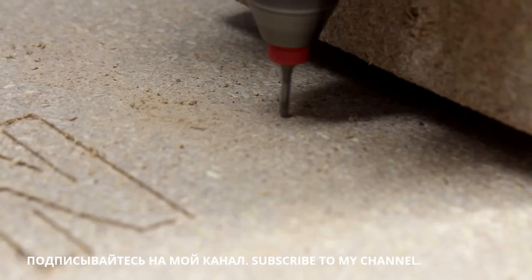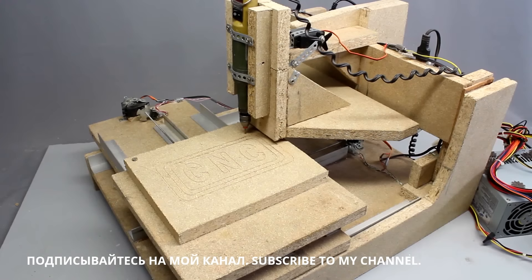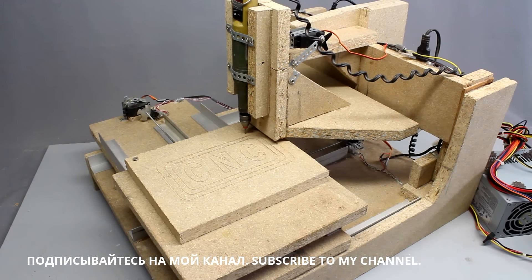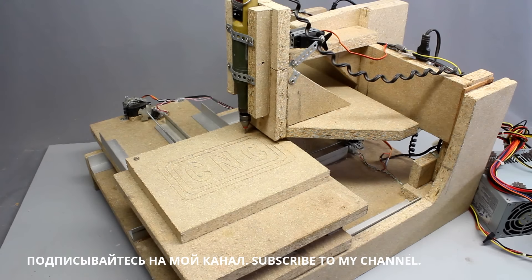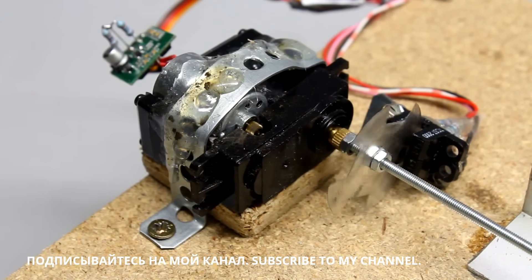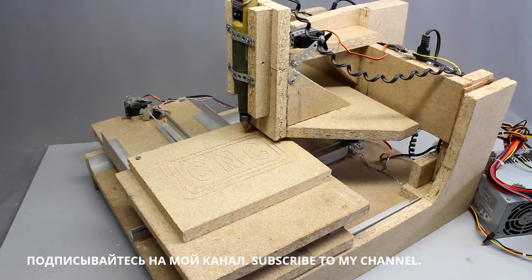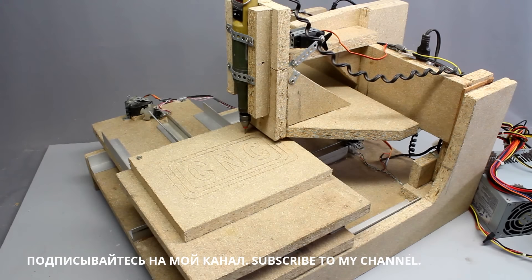This video is about a simply-to-build CNC machine. The machine has a work area of 20x20cm and a base area of approximately 50x60cm. It is controlled through an Arduino Uno and the axes are driven by three servos. The machine is composed of materials available in a DIY store. You can build this machine on a weekend using only a few tools.